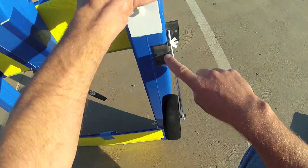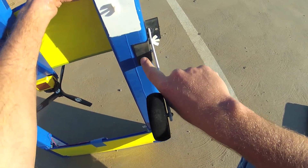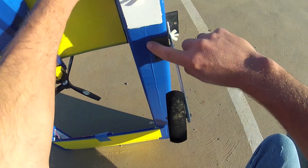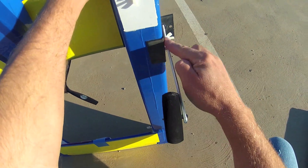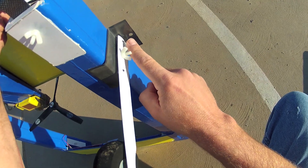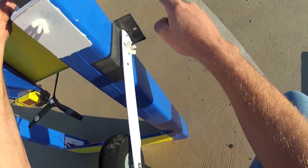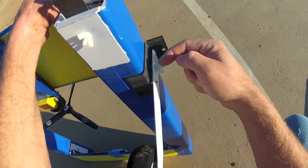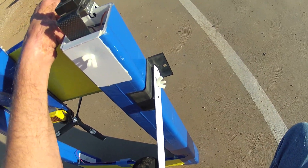These metal plates act as the load-bearing structure for the fuselage tube on the landing gear itself, and also as the mounting bracket for the wing, so that there is a screw that engages through this and through the wing, transferring all the forces from the fuselage to the wing pretty cleanly. The landing gear is in the formula as well.